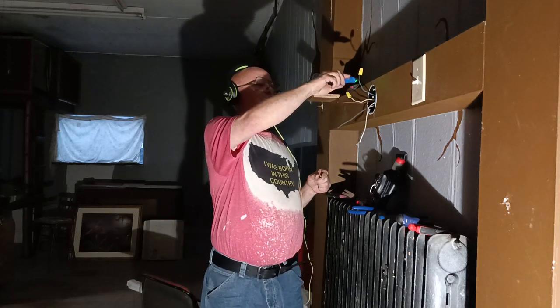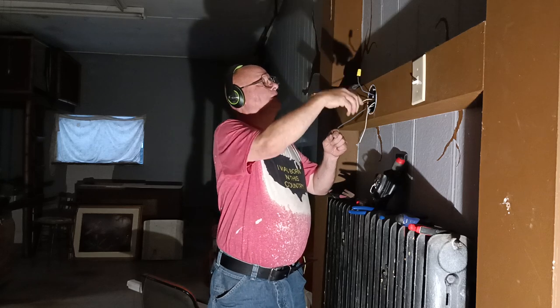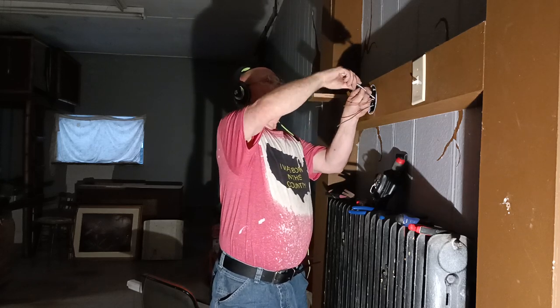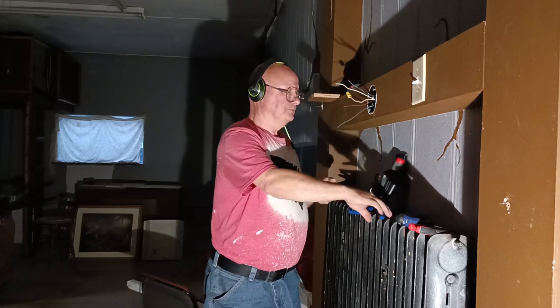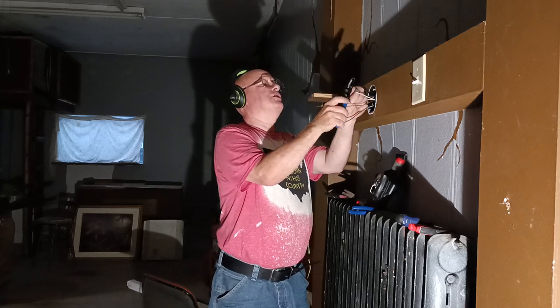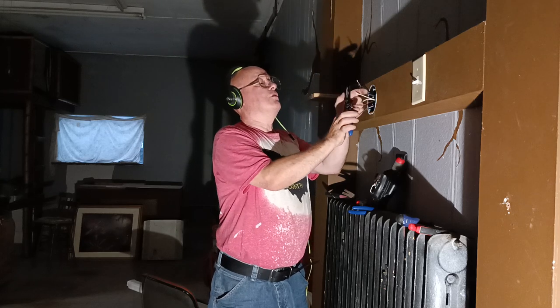Okay, we make sure our wire is dead now. So we take our black feed wire, which is from the power source, and we'll go to our white switch wire. So we'll just clip them like this here. Strip them with our number 12 hole.